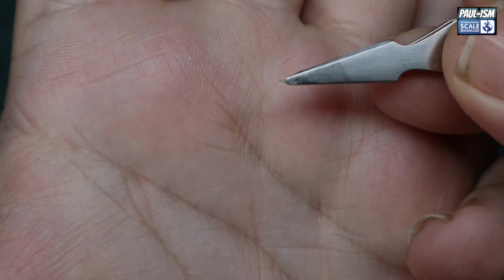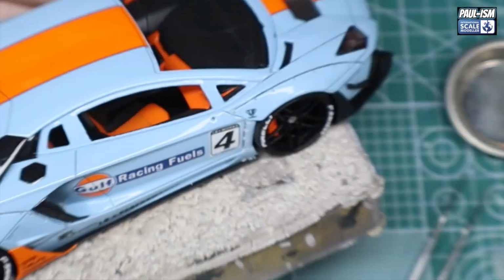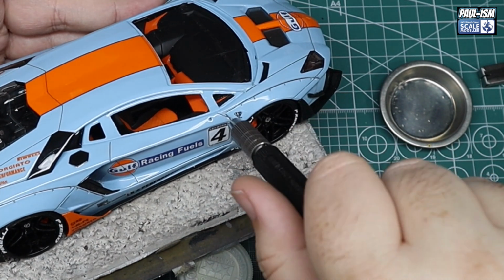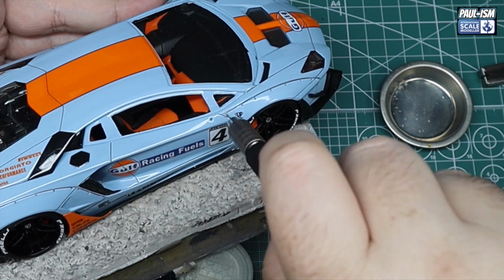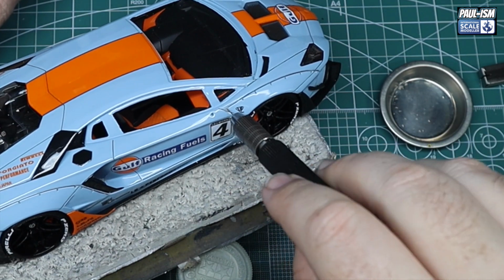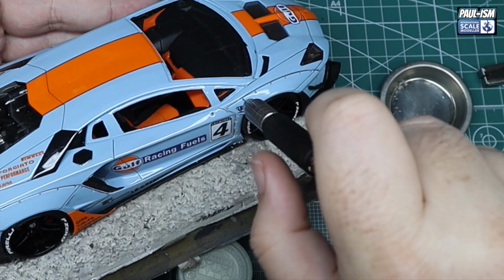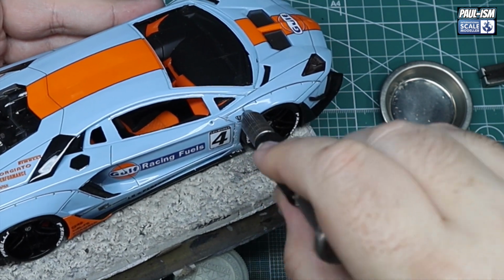And now, I believe we're doing our rivets. So we have 70 odd of these tiny little things. Give it a second. Look at the size of that. Absolutely tiny. We drilled all those 0.3mm holes before we started paint. And obviously we're clear coated now, so we're going to do it again. So nice gentle drilling, and I didn't break a single drill bit doing this, thankfully. We don't need to drill as deep because we've already drilled the hole. We just need to drill the remnants of paint and clear coat out, and then pop in the rivet. So yes, it's a bit of a laborious job.